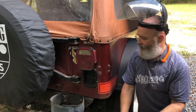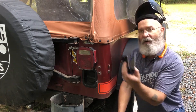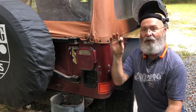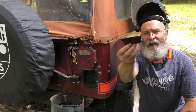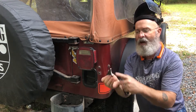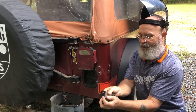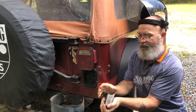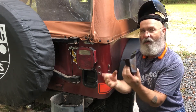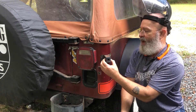Not wanting to do that, so what I've done — because of course I've already started — I've taken the mount off and got me a piece of bar stock that's an eighth inch thick. I've cut it to fit the top of this and just kind of contoured a little aesthetic contour so it will fit inside here. I'm gonna weld it on, get it all nice and cleaned up, put a hole in it for our antenna, and bolt it back up.